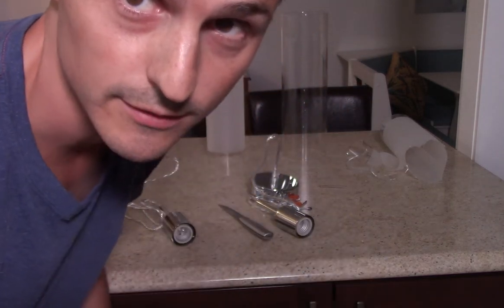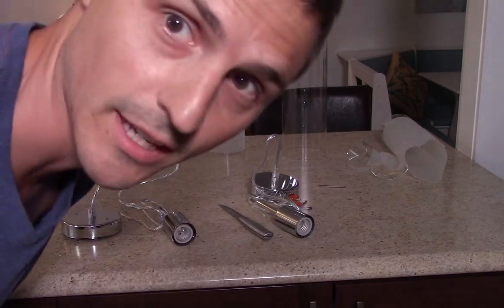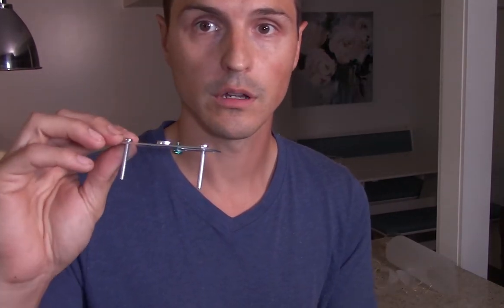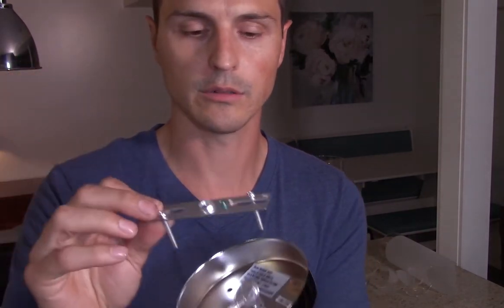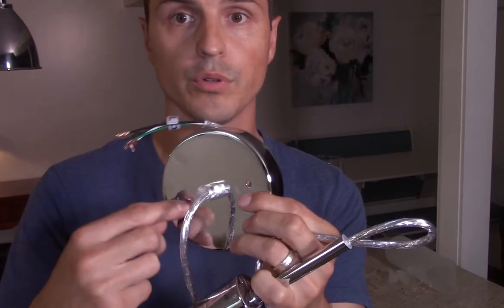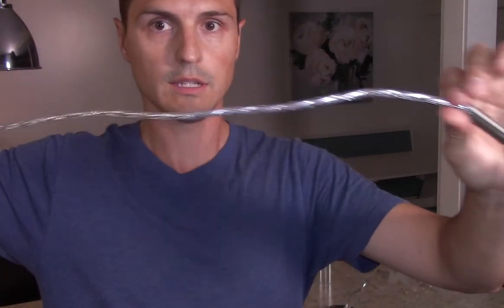And don't forget to read the instructions thoroughly — psych! Alright, so these things are fairly straightforward to install, just a matter of hooking up the wires and color-coding them. This thing gets screwed to the octagon box in the ceiling, which I'll go over, and then these two screws hanging down here go through the two holes and you put a finishing nut on them.